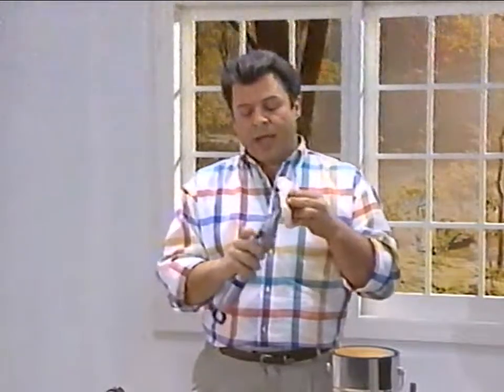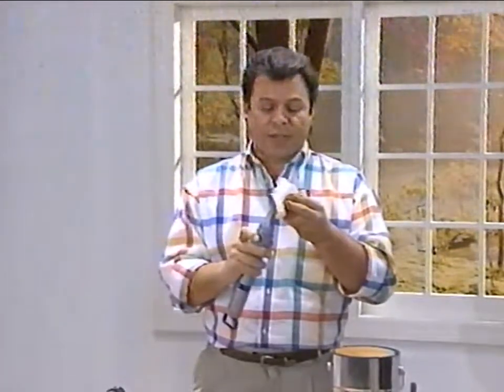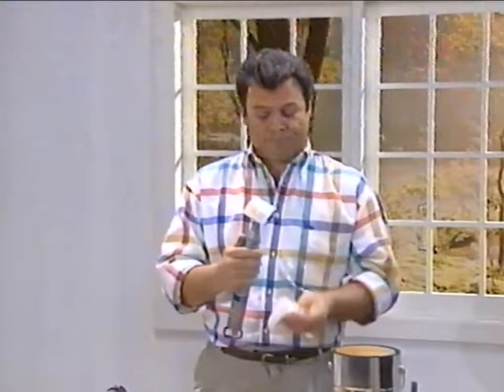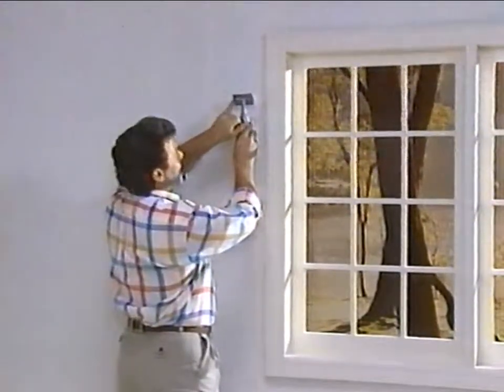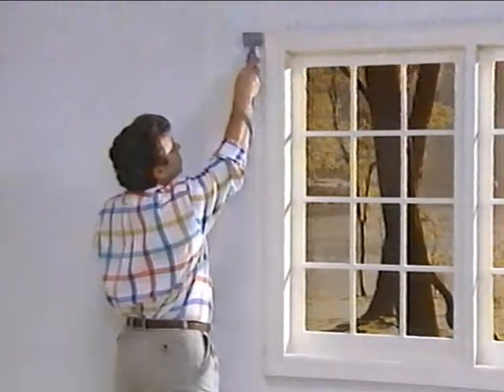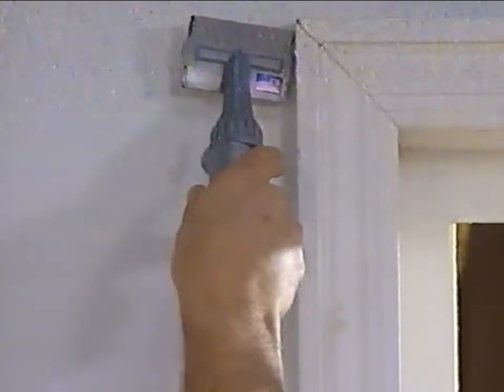One more thing before we start painting: when you pull the paint out of the paint can, sometimes you'll get a little bit of air in the chamber. So hold the chamber upright, put a cloth next to your paint pad, and just tap the trigger — this is called burping the Quick Painter. Keep pressing until you start to see the paint come out and you're ready to paint. There are two plastic wings on the side of the paint pad to use as a guide, so you can get right next to the window frame. Tilt the top of the paint pad in so it touches, and that'll give you a perfect cut-in all the way down.